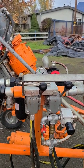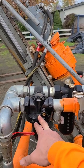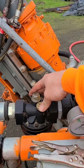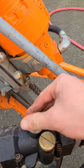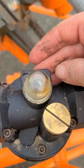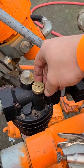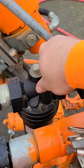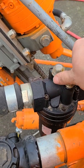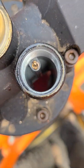Other than that, there's only a couple things to do on this rig. This is your air filter, and this is your inline oiler — you can see the oil dripping through right here. It should be one drip every three seconds, and if you're running a drifter, probably double that. This here is how you fill the oil — it is a brass fitting, and your oil goes right into the tank there.